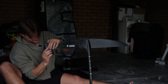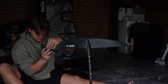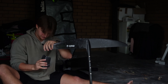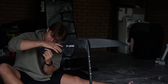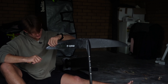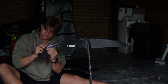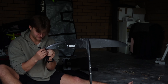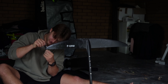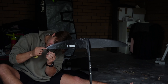Just trying to really get into this winglet here — it's not the easiest bit of geometry to get into. I'll go back to just using the paper. Something you do as well is run your fingers along the chord of the foil just trying to feel any bumps. I'm not trying to fair it, but unfortunately with geometry as small as this little winglet, it's really difficult to take an even surface off.